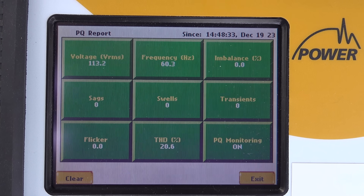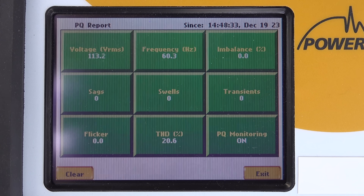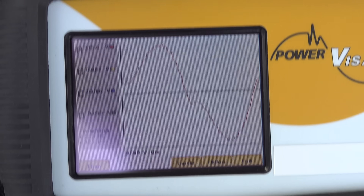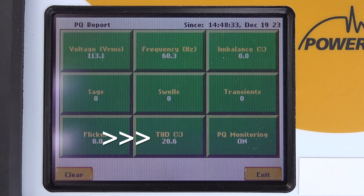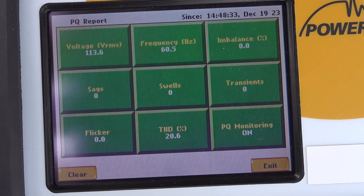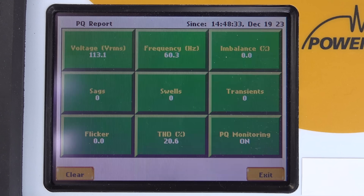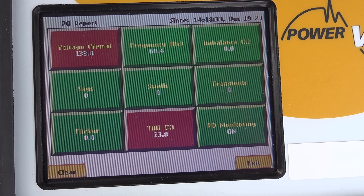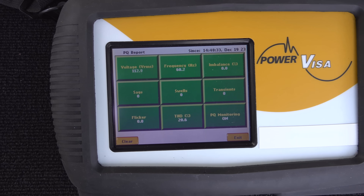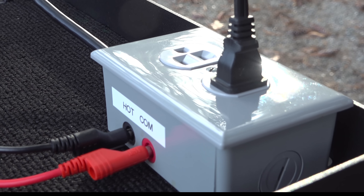This analyzer checks over a hundred different functions and then correlates them into a report card — and green definitely means good. You can see the voltage in the upper corner is fairly steady at about 113 volts. The only thing you may be concerned with is the value THD, which stands for total harmonic distortion. Harmonic distortion is a kind of fluctuation in the voltage output, but in generators that aren't inverter-powered it's safe to have your harmonic distortion up to about 20% before it's considered a problem. When we switch the heater off you can see that when it's idling things are much worse, but once this thing is outputting a load, things stabilize — your voltage looks much better. This generator should work fine for things like refrigerators, electric pumps, and drills.